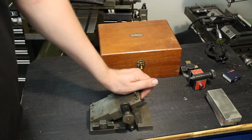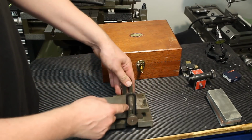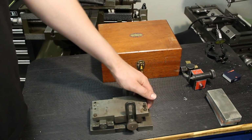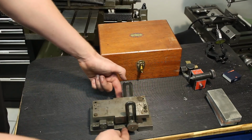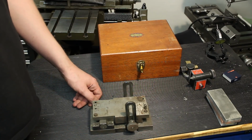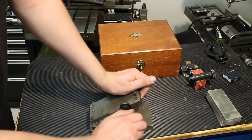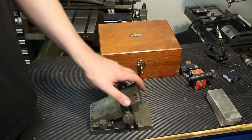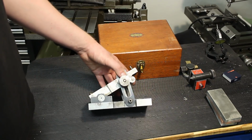This design of a sine base is not brilliant because those two strap clamps here are always in the way when you have it set to a low angle. There are designs with arc-shaped straps, and those are more accessible. I'm not sure if this is a bought one or if this is shop made.